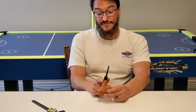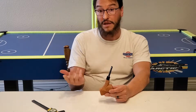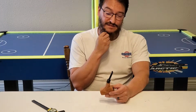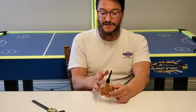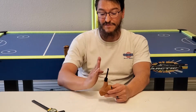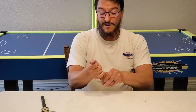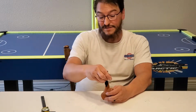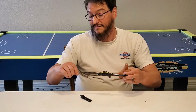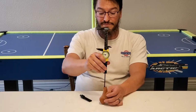The bottom one is tough, because really too much material was removed right in this spot right here. And I can't add material. So I'm going to have to do something that makes that less visually popping out at you. And maybe it involves tapering this part of the stem to match that angle. If I bring this thing in like that, one thing I'm concerned about is where this part lands and where the air shaft is. I don't have a lot of leeway there. I can get this out here to show. The air shaft is right there, right? So I have some. I guess I can bring it in some.